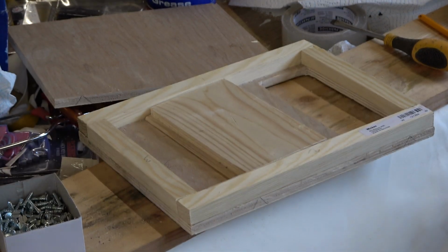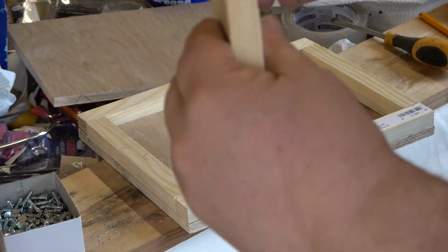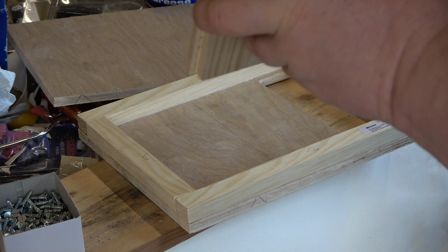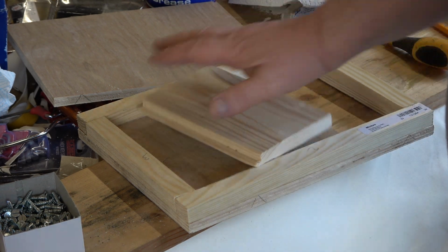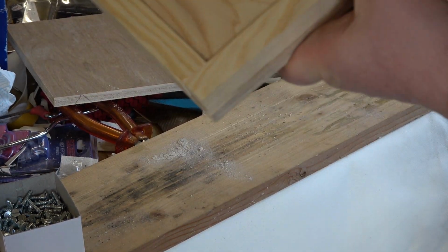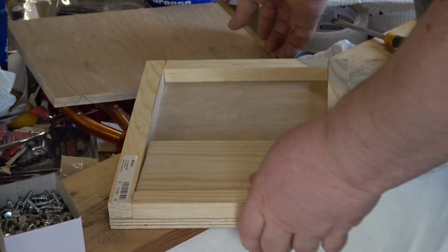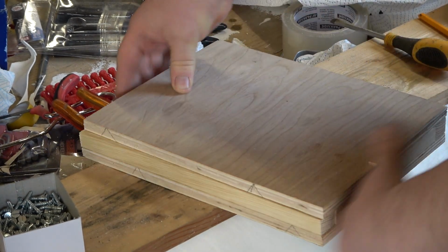We're going to be using 3/4 inch 8 screws, which of course will be slotted as is required on organs. So they're going to be drilled, and they're going to be clearance drilled. They must never be body bound. I look at builders putting in things, and the screws are just forced in and body bound. In the organ building, it must be clear if it's going through the material just binding to what it's going into. So I can demonstrate with these temporary screws that these pull in and out through the holes quite readily, and that's how it has to be. So we're going to do that.